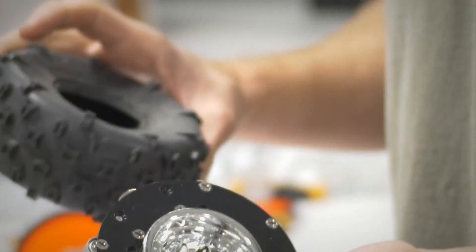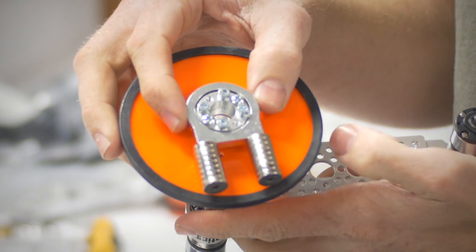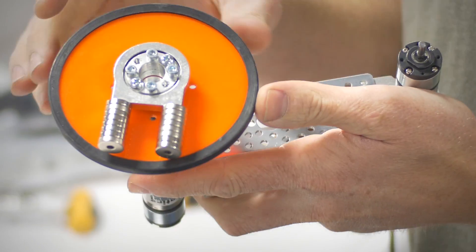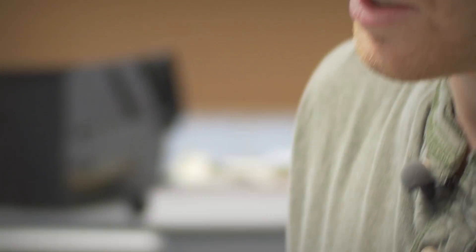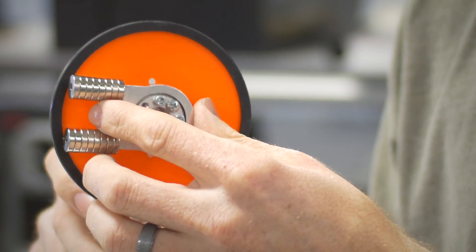We're going to need a few less magnets in the next version. Well, I've gone full circle on the build — from very complex to very simple — and I've tested both options. While I think the simple route is going to be good for a one-day build, I really just can't let this option go. So I've simplified that down a little bit and started to build my chassis. You can see I've got some magnets on a one-inch bearing mount, held on with a flathead screw down inside. These magnets just swing totally independently of the wheel as it rotates. My hope is as you drive up to a wall, these magnets will swing up and lock, then you can make the transition to a vertical plane and drive right up the wall. I'm going to duplicate this for all four wheels and put a motor controller on it.